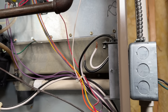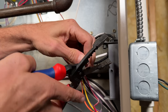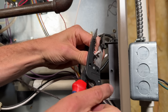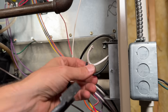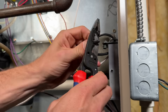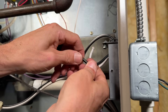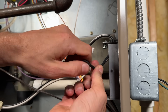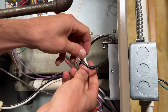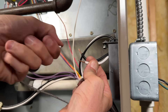For the stranded wire — most hot and neutral wires from the furnace will be stranded — I'm going to clean these up. I'll strip some new insulation, but first use the cut insulation as a means to get a tight twist on the stranded wire, making future wiring easier. You often see this in light fixtures where the insulation is pre-cut and you just use it to twist the strands together.